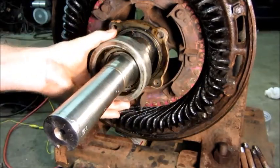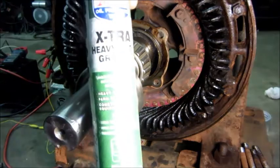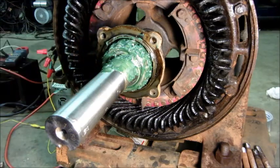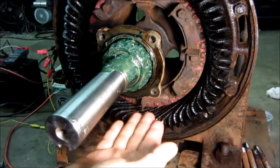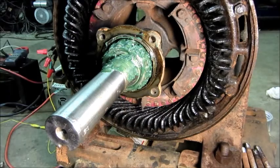I cleaned all the old grease out and I'm using Lucas Green Hi-Tac grease to repack the bearing and put the motor back together. Got the end bell on — trying not to contaminate that fresh grease. I need to set the shims to get the rubbing out of there. I think the shaft is sitting a little low because of loose shims, causing the labyrinth to rub on the shaft. That's what that noise was — it sounded kind of like a centrifugal switch.